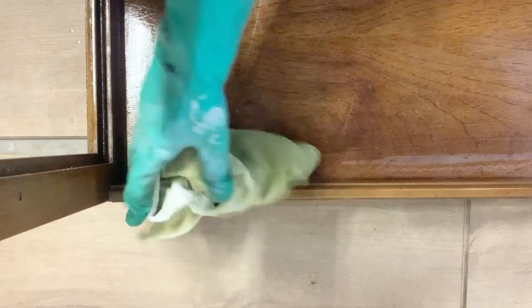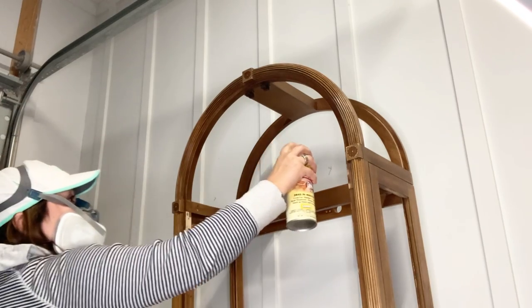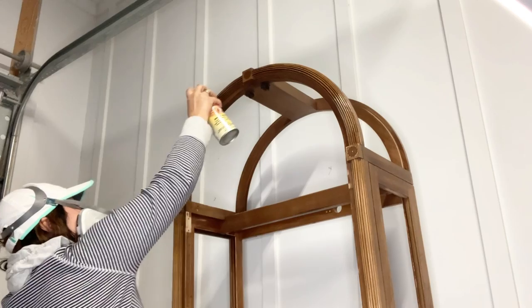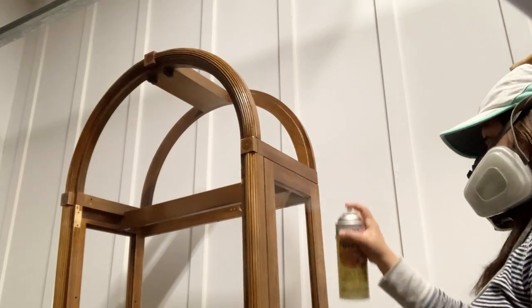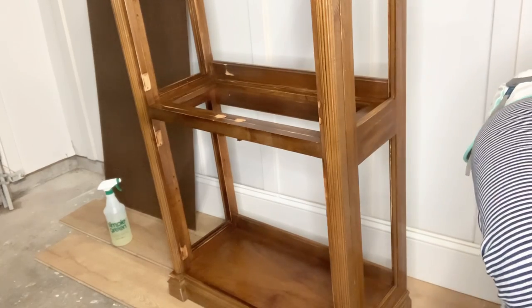The frame of the cabinet is gonna be painted with Coal Black from Fusion Mineral Paint, and I'm using this clear shellac to prime and block any wood tannins from coming through the new paint job. I'm gonna be applying a total of 3 coats and waiting an entire hour after that last coat before I can start scuff sanding in preparation for paint.